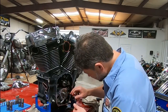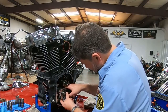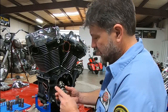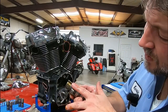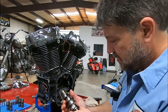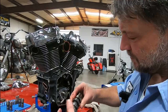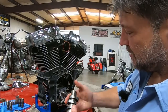Let's move to the oil pump. Man, this thing is full. Well, let's pull the cam first. We've got powder-fine metal on the cam here. There was a small piece there. But the cam lobes look fine.